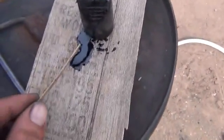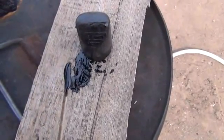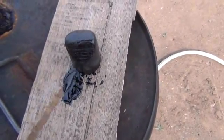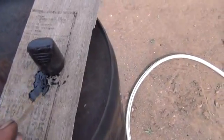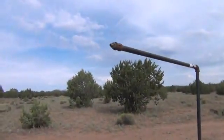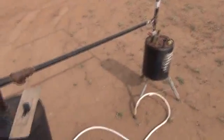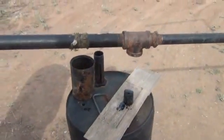Let me take a stick here and show you what it looks like. It's a nice crude oil — very, very thick and nice and black. This is going to be the thickest and heaviest grade of the crude oil that we catch throughout this system. This is the first stage of recovery, the first stage of capture of bio crude. That's the first can. That's going to be a slightly better refined stage of crude. And then out of the third stage, after it goes through the two radiators or a single radiator and a condenser, we'll have the third stage which should be a much more refined state of crude oil.